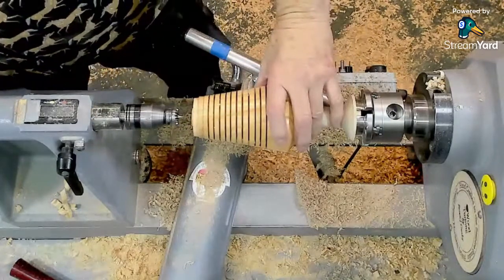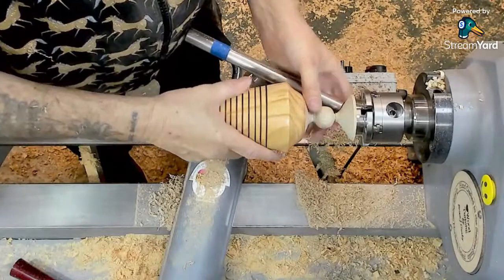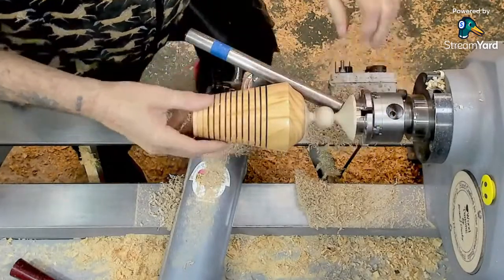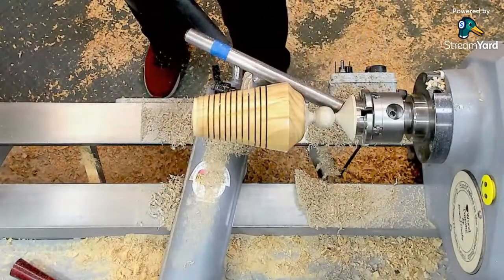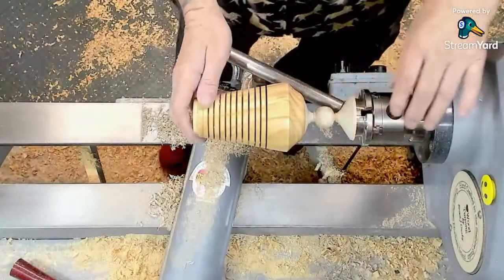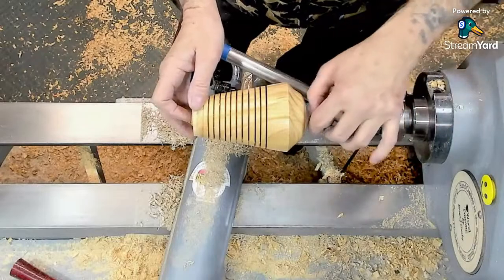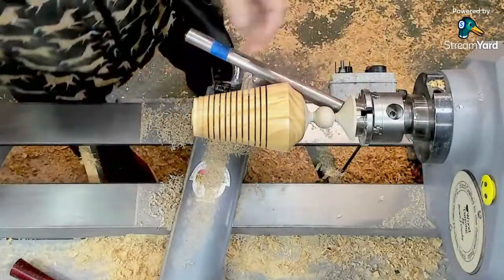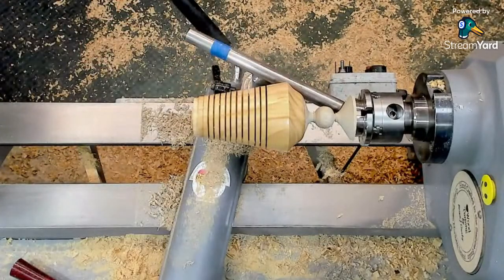Just for now, slide all that rubbish out of the way. Will that come off? Snap it off as you do it. Oh, easy now. And a straight tap with a rubber mallet. No, I'm going to part it off first and then pull it out. I made that too tight. Said that, didn't I? Oh dear, oh dear. Give it a little tap while you're pushing against it on the other side so you can tap it off, and then you can sand that so it fits properly. You want to keep it on the lathe so you can sand it. Hold one side and tap the other.